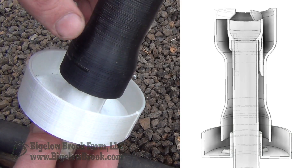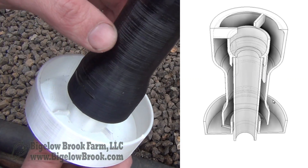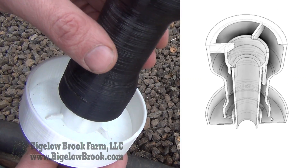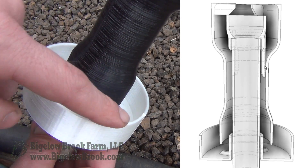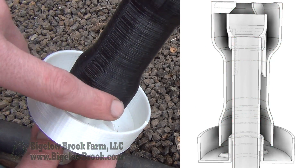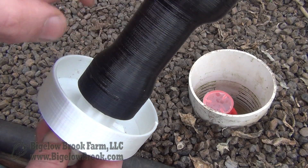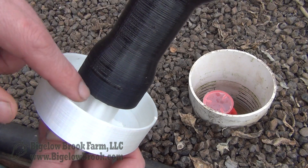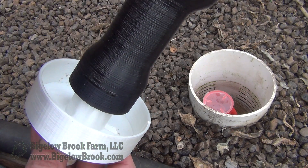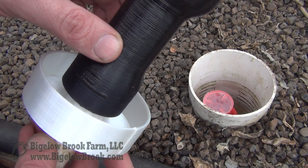What I had done with some other models is widened the bottom of the bell out so that it would occupy more space of the cup. But what was then happening is I was getting too much friction of the water between the outer wall and the bell, and as the water was flowing through, it would force the cup to stay downwards all the time until the bell would finally break. So really this wasn't acting as the proper hysteresis.